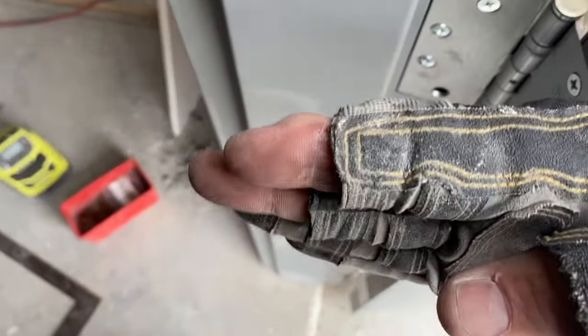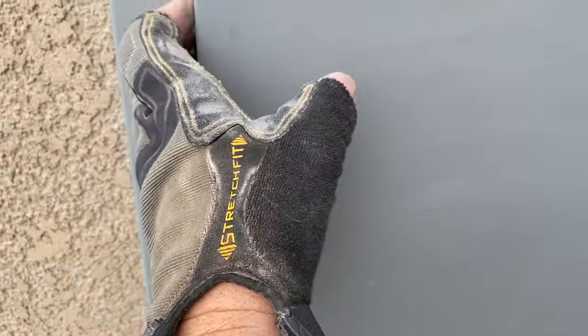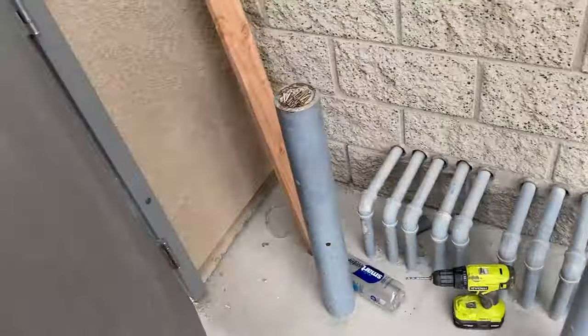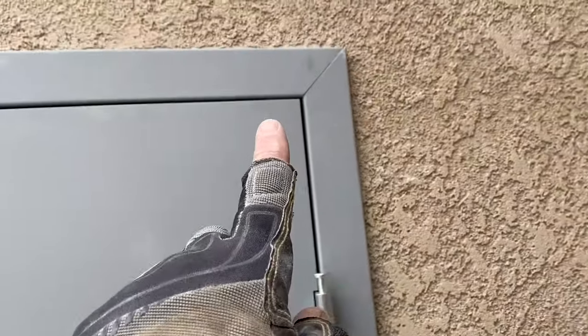Now the hinge, instead of being flush with the door, is tilted — and that's going to push the door to the left. You see it's got a nice uniform gap here and a much smaller gap here. This gap is a little close, so we'll do it again and put in those screws one turn each. All our screws are back in, everything is snugged down — this should do it. Look at that: perfectly uniform gap top to bottom on both sides, and the top gap is perfect.